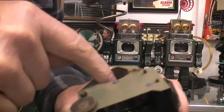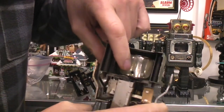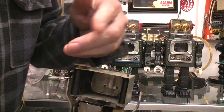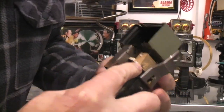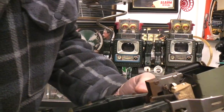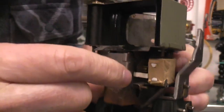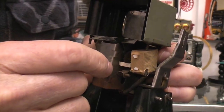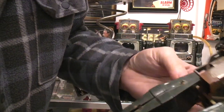Down inside this hole they put a light bulb, and that same light not only lit up the pictures you'd see through the magnifying lens on the front, but it also came up through here to light up the mouth for the color wheel effect. This is the screecher — the thing that makes the screeching sound. As the leg part moves back and forth, it tips that piece of cardboard and the little wiper toward or away from the gear. When it hits the gear you hear screeching; as it's pushed away you hear less. So it's a little sounding device with a screecher feeler built in.